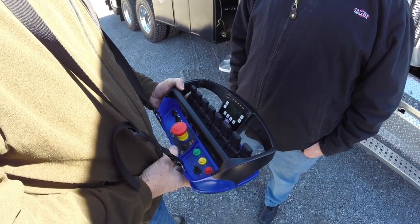The E-stop on the RCL is a twist out that will show a yellow line when it is out. You never have to touch that E-stop when you are finished with the crane — you can leave it out at all times. The buzzer here will sound when we hit 90% of load or when our EVS is active.